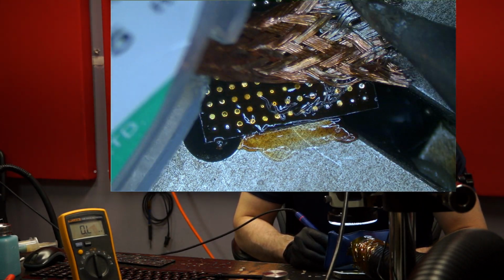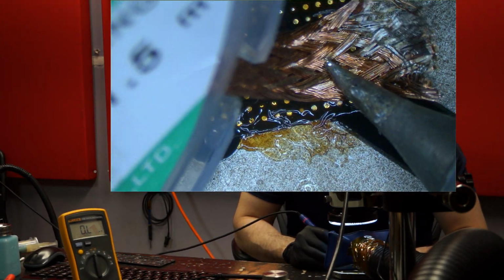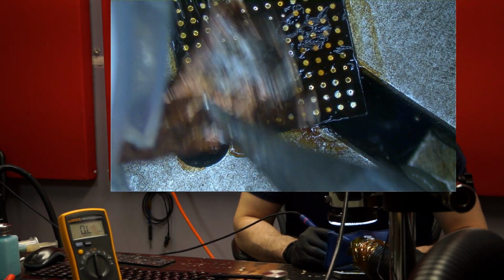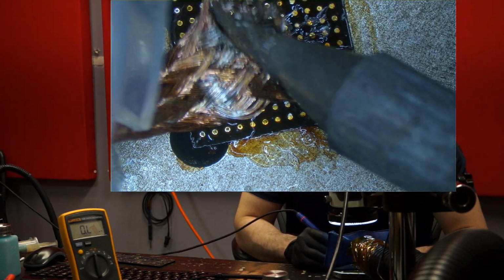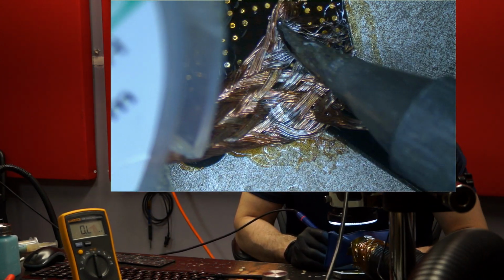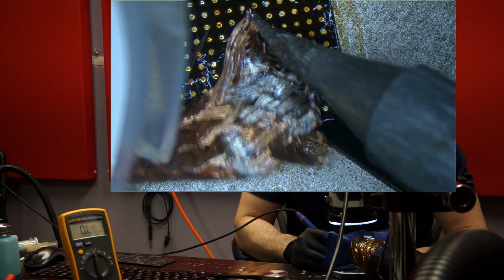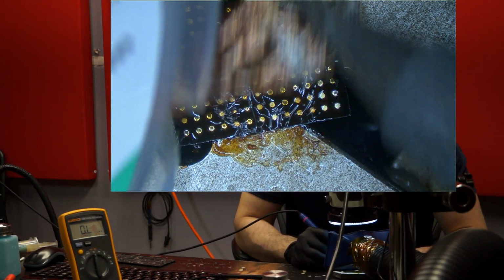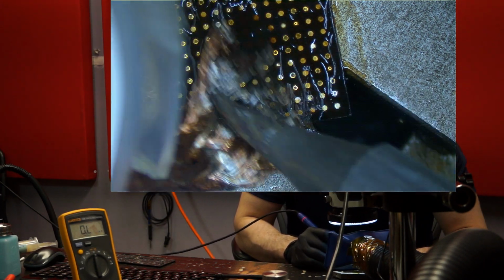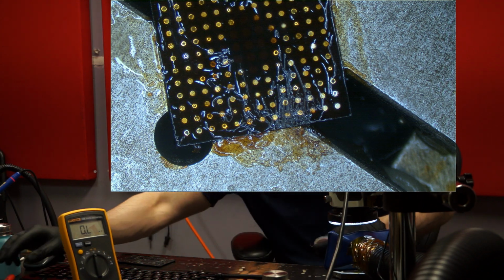This is an SMC, System Management Controller. This does things like, hey, see the battery. Hey, charge the battery. Hey, what temperature's the CPU? There ain't nothing proprietary here. There's nothing special here. There's no trade secrets here. But if you try to read that chip, you better not. No way in hell are you programming new chips. No, you gotta rip them off of liquid damaged dead motherboards and put 96 little balls on it and hope that it works. Screw you.